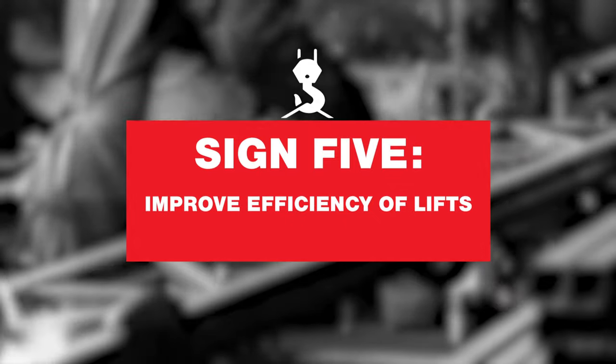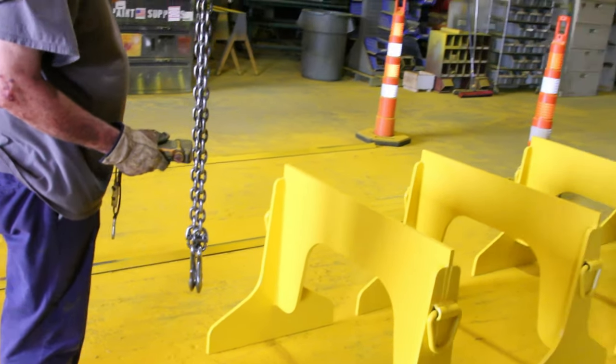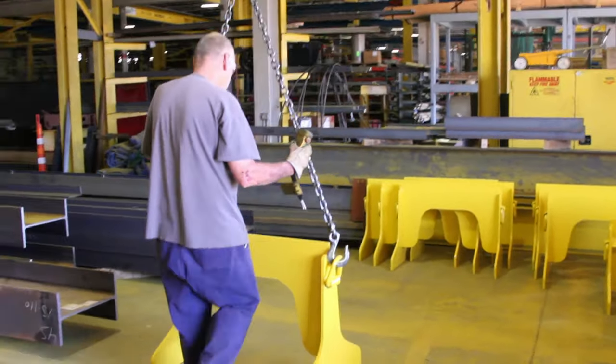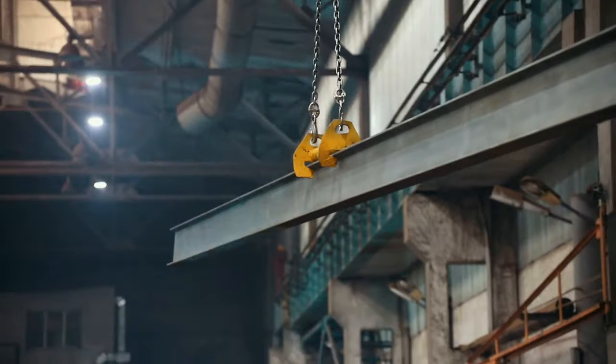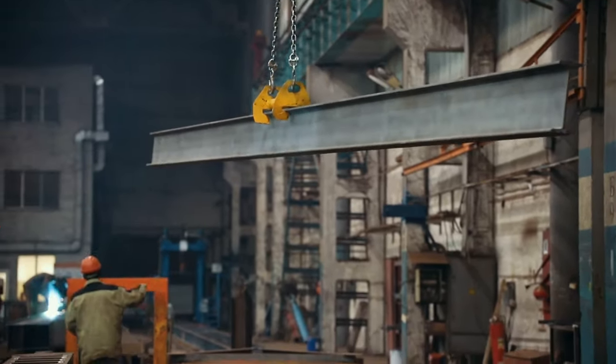Five, you want to improve the safety and efficiency of your overhead lifts. Today, most businesses with an older crane are replacing and modernizing their crane's control systems, replacing the operator cab with push-button pendants or remote radio controls. The most important reason companies are converting to pendant or radio controls is safety — the operator has a much clearer vantage point from the ground to identify and react to obstacles, personnel, and hazards while the crane moves through the bay.